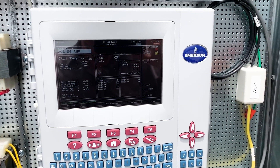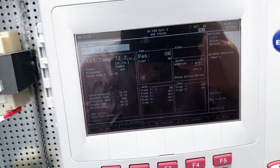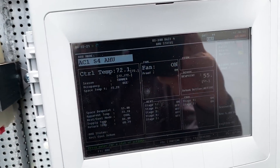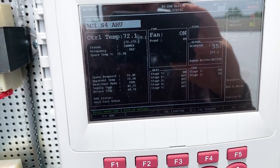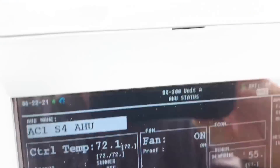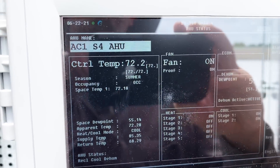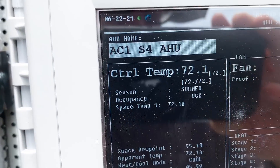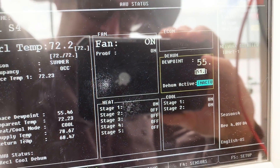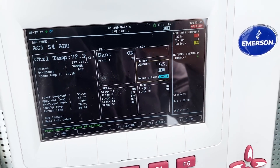Come to find out, I thought I was doing good, but apparently the dehumidification signal to the valve was flipped. That's interesting — it was reacting so erratically because I was calling for dehumidification. The store came down to set point while my water was still cold, but then came completely off of it. As you can see we're back up to 55 dew point. But I flipped the analog output to the valve and now my supply temp went from 55 to 85. We'll see what this machine does if it brings in that other compressor. Space temp still good. So hopefully this pulls down the dew point. I have it overridden to inactive, which is giving me closed. I'm going to take it out of override and it should come back in. See, my supply temp's already dropping.